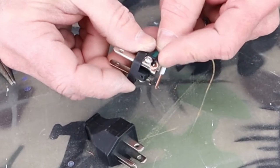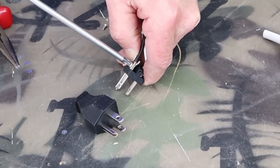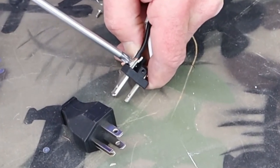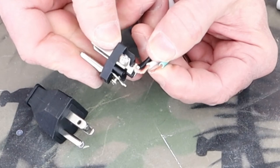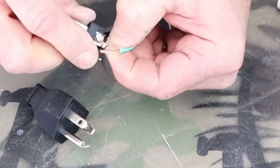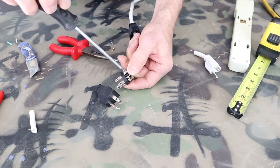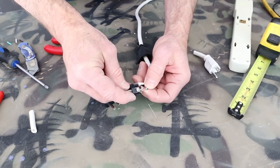I'll fish my hook around the screw clockwise — tightening the screw clockwise will draw the wire tight. Next I'll attach the white wire: I've made the hook and I'll fish it around clockwise, and now we'll tighten it down. And the green wire in the same manner.